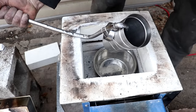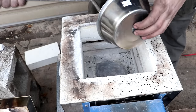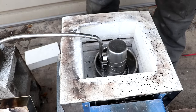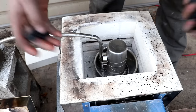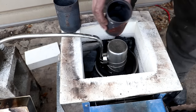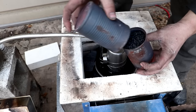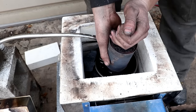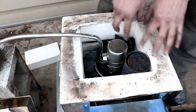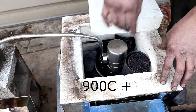I don't want to fill this all the way up — just do maybe three quarters of the way full. As for the charcoal to remove the oxygen, I'm going to use these large pieces so I don't get them confused. And as for the charcoal that I'm just heating up without the steam, I'm just going to fill up a little soup can here, put it inside of another soup can, add some charcoal around that to keep the oxygen and steam out. That'll just set right there so it gets heated the same. I'll assemble all this back up and heat it to at least 1700 degrees Fahrenheit.